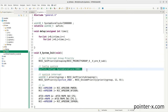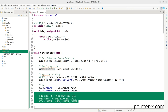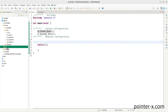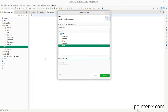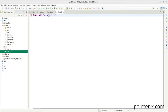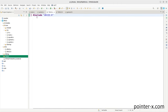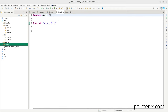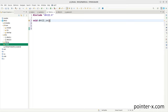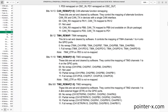The starting project is named dht22. In SystemInit, priority grouping is set, SysTick is configured, and Power and AFIO peripherals are enabled. Clock is set to 72 MHz. Right-click the lib folder, create dht22.c and dht22.h. In dht22.h add include for general.h (CMSIS and system headers), add pragma once, and include dht22.h in dht22.c and main.c.